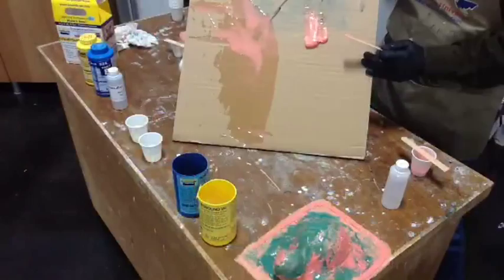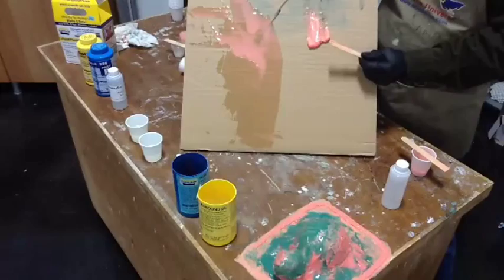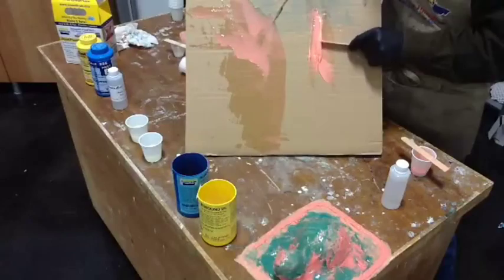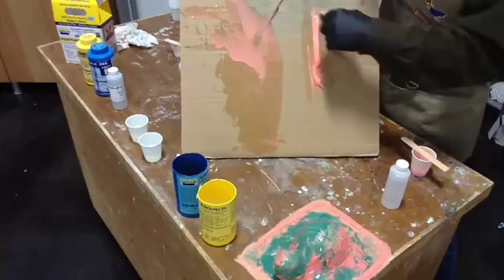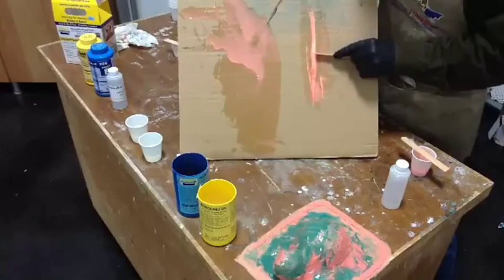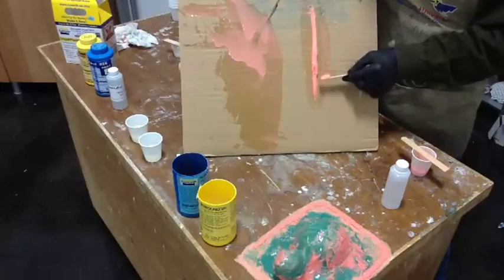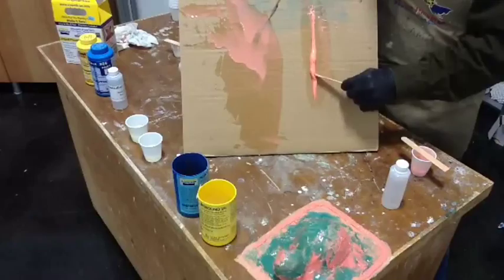All right, now, next thing. If you were doing a head cast or you were doing a shape where you knew darn well you're going to have to cut the rubber, you would want to make what's known as a fat line. When you add Thivex, it makes it very possible to do a fat line just by sculpting it. Now, you don't always get it on the first pass. Sometimes it takes more than one. But as you can see, it becomes really simple to create a fat place in the rubber. So if we let that firm up, and by the way, neither of these chemicals really affect the cure time of the rubber. All it really does is just thicken it. But we let this batch firm up a little bit, then we could come back and shape the side and get a flat edge, which if that was where your jacket was going to come together, is going to be very helpful.